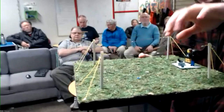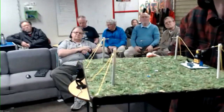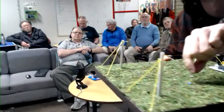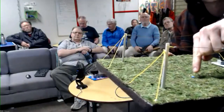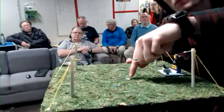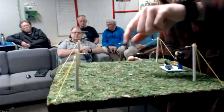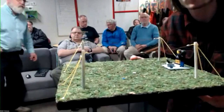So in order to shift the phasing of the antenna, I added this phasing cable in. It's really hard to see, but it goes from this blue thing right here to the power combiner right here. So that's an extra 1/4 wavelength, with the velocity factor, of course, being accounted for.